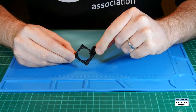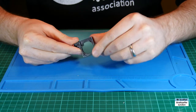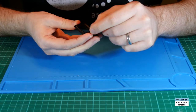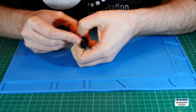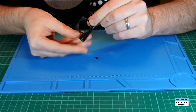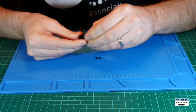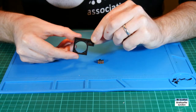We've got the 3D part here now — the machine cooled down and it popped off very easily. The first thing I normally do is clear off any little whiskers of plastic or burrs that might be left. You'll remember we had to put in supports for these structures here, so we need to break those out now. They usually come out quite easily — sometimes with a bit of force, and other times side cutters are necessary.